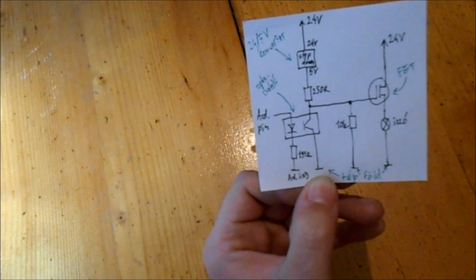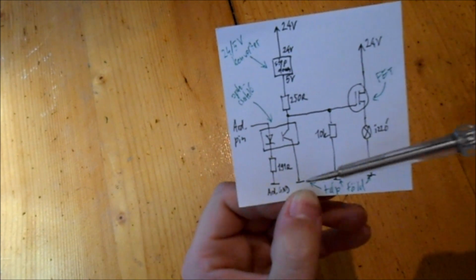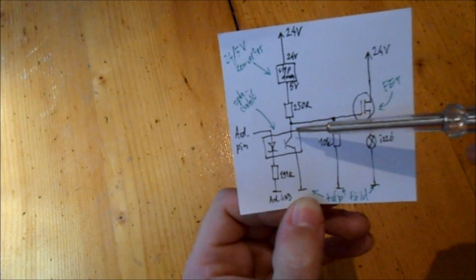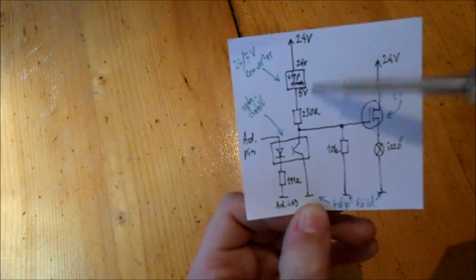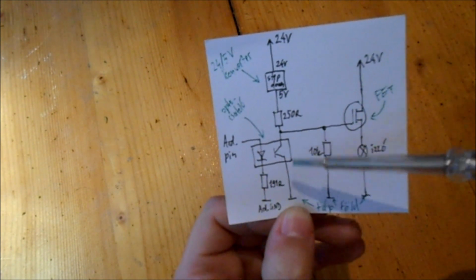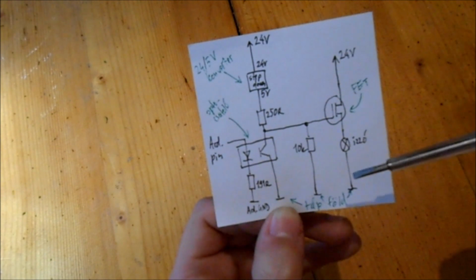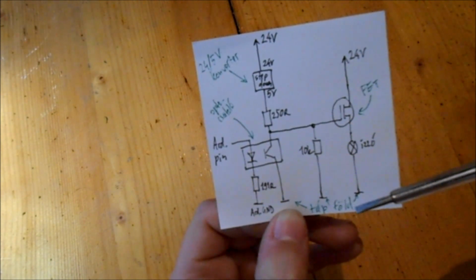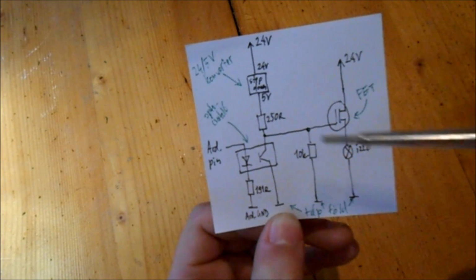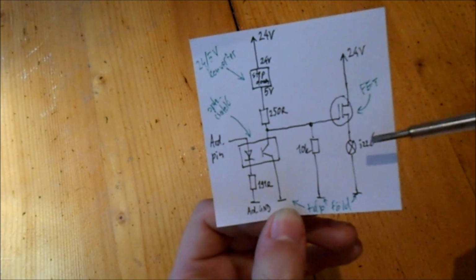It's not likely that it could cause any harm, but I still don't want to give any chance to ruin anything, so I will use optocouplers for that reason. Of course, these cannot handle large currents, and also they need 5 volt supply. To drive a light bulb with these, we need some relays or MOSFETs. The relay modules are easy to use, but I don't like their clicking noises very much, so I will use FETs for this purpose. Of course, we need a gate resistor too. Anyway, we use the FET to switch on and off the bulb to the 24 volt supply.